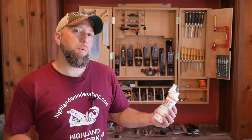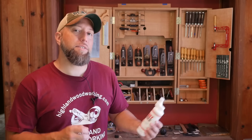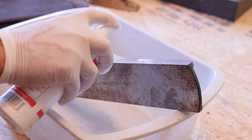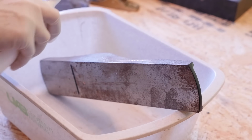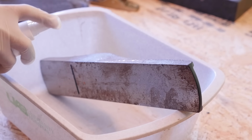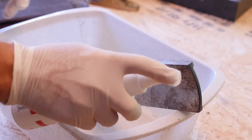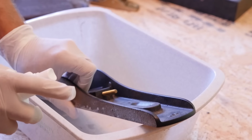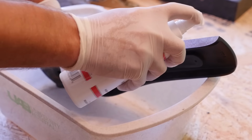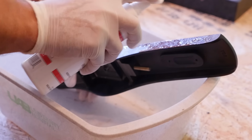Rust-Free is a light acid that helps loosen heavier accumulations of rust and gives you a head start in removing rust. Obviously, when handling any acids, it is important to use proper precautions like disposable gloves and eye protection. As a side note, anytime you have a liquid shipped to you, you should open the shipping box immediately and stand the bottle upright on a surface that can handle some spillage or leakage from shipping, preferably not your furniture or machine tables.